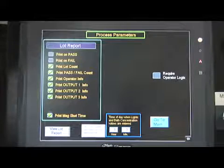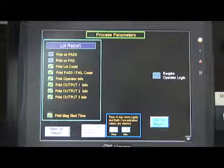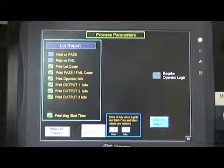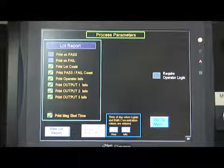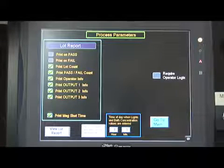In the bottom middle of the screen is a reminder to check the black light UV intensity, white light in the inspection booth, and bath concentration if applicable. This reminder can be set to appear on the main screen whenever desired. It is recommended to be set at a minimum of every 8 hours, the equivalent of a typical work shift.